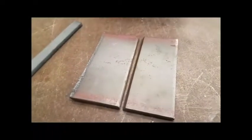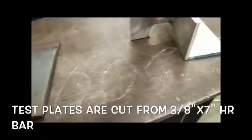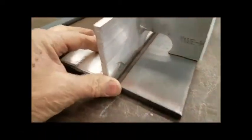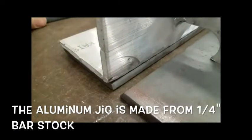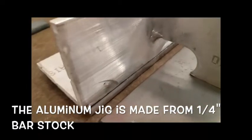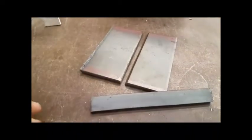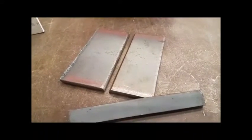The setup we've devised is to take a couple plates like you would normally do a weld test. We have a square edge and this would be cut out of 45 degrees. I've got aluminum set up here because the aluminum won't stick to the steel as it's welded. You put your backing bar up under there, then you can weld the whole thing reaching through the rat hole with a backup bar, remove it, cut the back off, grind it, and do a bend test on your root and your face like you would on these 3/8 test plates.